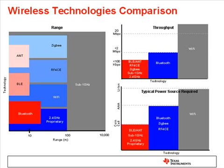From a power standpoint, as you can imagine, since Wi-Fi is the highest throughput, it will require the highest power. A misconception, though, is that Wi-Fi requires line-power, but however, it can be battery-powered, in this case by lithium-ion. Bluetooth, however, can be powered by a AAA battery source, and then your BLE, ANT, and proprietary technologies will be possible to use a coin cell, so very low power there.